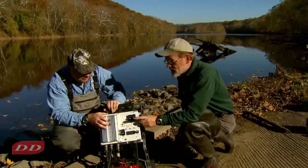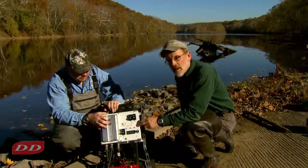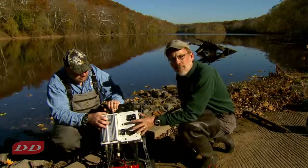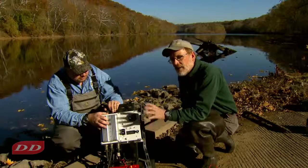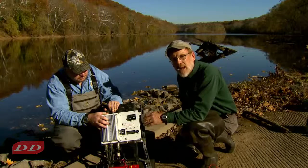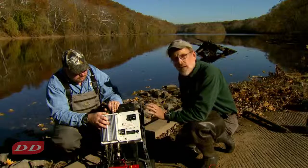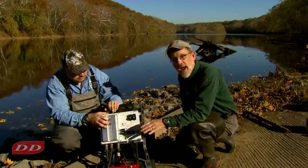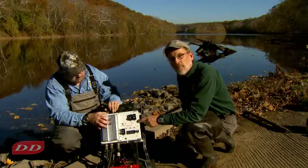The next step is to get inside the control box itself, but there's an important warning: these control boxes have capacitors that fill up with charge. They self-bleed after you stop electrofishing, but that self-bleed may take up to five minutes. So once you're done electrofishing, disconnect the battery and wait five minutes before opening this compartment.